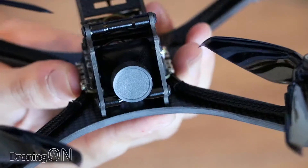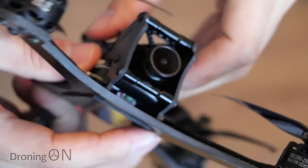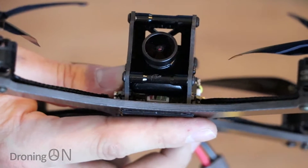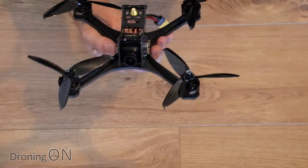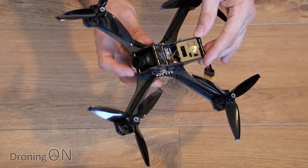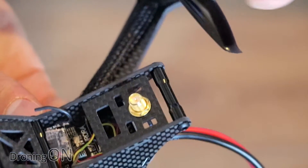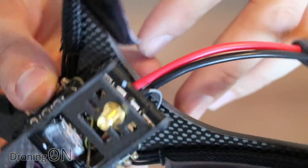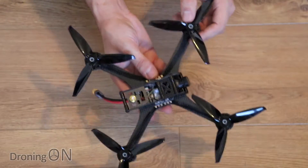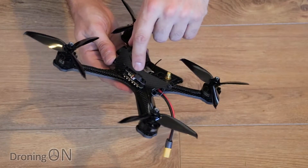Attached to this VTX is a beautiful camera and I think this is probably my favourite feature of this quad. Although the camera looks like a RunCam, it's not — it's a Sony camera, 960H, and it is a CCD camera which is lovely. It's got a beautiful 2.5mm lens giving an FOV of 135 degrees. It's also programmable, although the only problem is it's a bit of a pain to get to the back of it because of the way the carbon is built around it. On the rear we've got the antenna connector facing upwards, unlike the Kopis One which is designed for racing at 60 degrees constantly. This fitment is more suitable for the casual flyer rather than the racer.